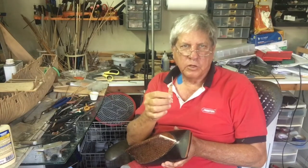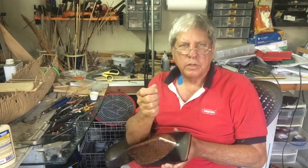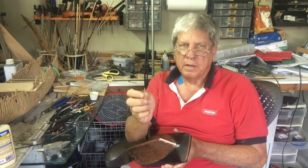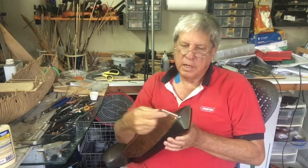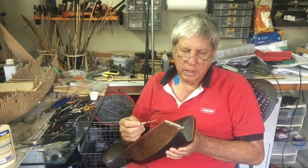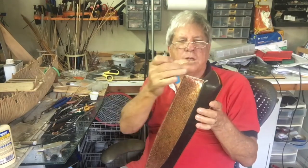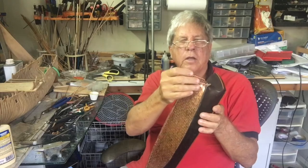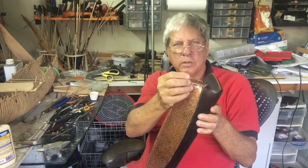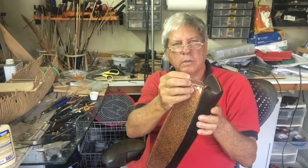You'll see that this is made much more to the instruction — the post is as far forward as possible and we've got the required bend in the back. Having said that, we still had to take a lot of plates off the stern post and shave it down a little bit, and even though we have taken it down and adjusted it, once I put the pintles in I find I still have to take some more of the stern post — maybe as much as another one millimeter.